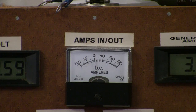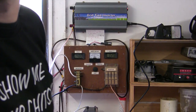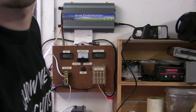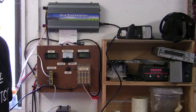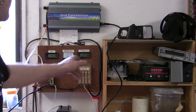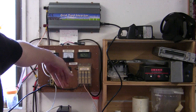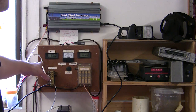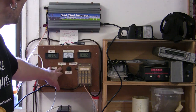I have a 120 watt panel on the roof and a small 20 watt panel. I'll be getting a normal charge controller hooked onto the 20 watt panel, which will keep the batteries at float — stopping the clicking on and off. It will charge them to 14.4 and then once they're charged, it will turn off and let that small panel float.